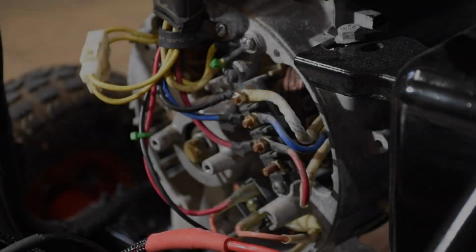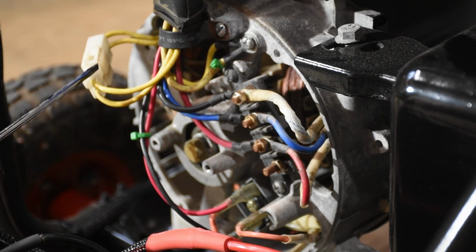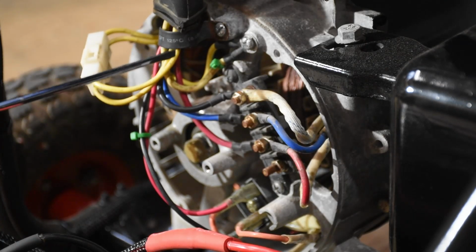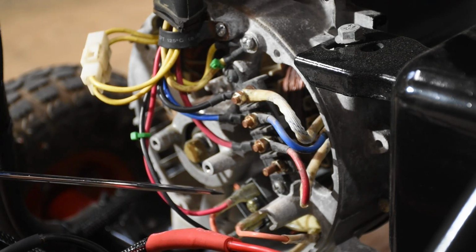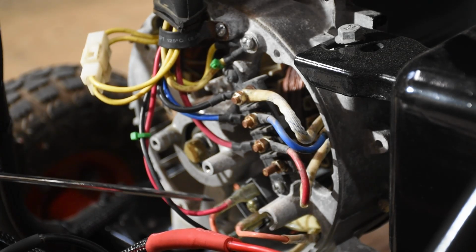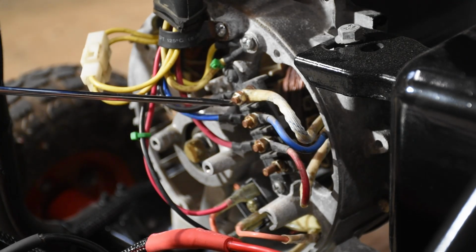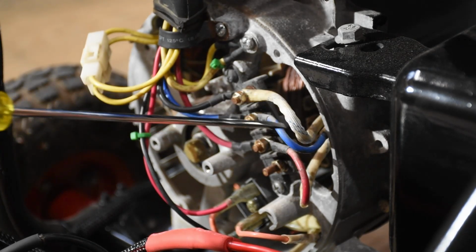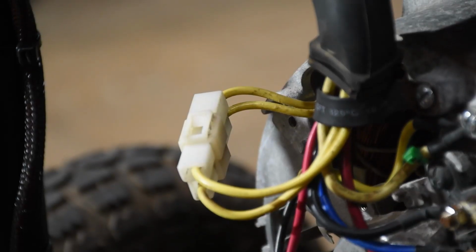Thanks. Okay, as I wait for my friend to come down, I'm going to take the end cap off the generator. Now this leg here actually runs up to the capacitor, which we're going to have to test. But you can also see other parts of the Jenny. This part down here is the 12 volt rectifier. These lines that are coming out should be 12 volt if it's running right. And these three knobs here, three nuts, are the two legs of the 120 and 240 volt AC lines. So we'll be checking those as well.